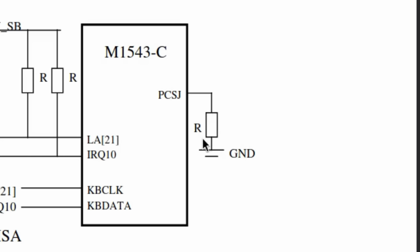So I went through all of the parts around the south bridge and searched for the resistors which are connected to the ground and could potentially be the pull-down resistor we are searching for. And after some poking around, I found something. Do you remember this mess? This is a resistor network which I previously cleaned, where two resistors are connected to the ground on one side and with the other to the traces which disappear under the south bridge. So I tested this resistor network and it turned out that the second resistor shows infinite resistance. In other words, it's basically dead.